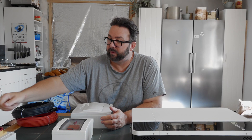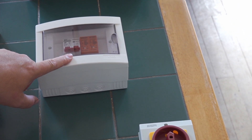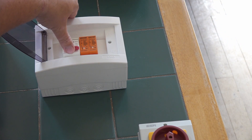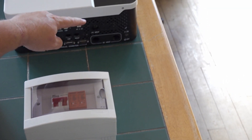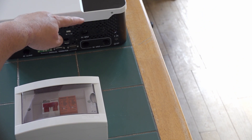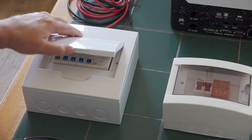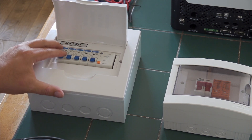So the solar PV panels come into the disconnect — I won't call it a breaker, it's just a disconnect — into the bottom, with your 6mm cables. Then it goes from the disconnect up to the breaker box where we've got a 32-amp breaker and a surge protector. The PV wires come out of that box up into the inverter, and the AC out will be coming out to our distribution board. We don't have to have it grid-tied.